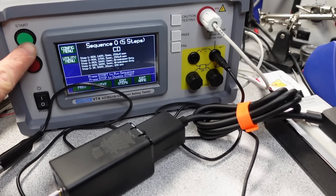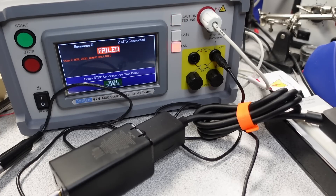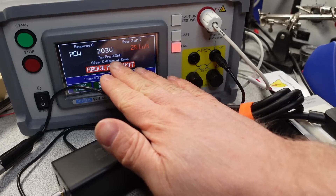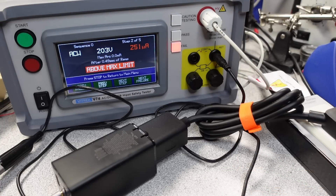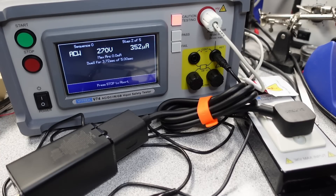Adding a new set of tests here - this is leakage testing, or insulation resistance, both with AC and DC signals at several voltage levels. I didn't do a high pot or a dielectric test. The leakage current is the thing that gives you that tingling sensation from certain power adapters when you touch your device. There needs to be a new study on this for just detectable level, because it's a lot lower than what I've seen - 1 milliamp - and these new power adapters are performance-wise all over the place. This testing is super dangerous and my test setup on this is very temporary, but video must go out, so don't replicate this part.